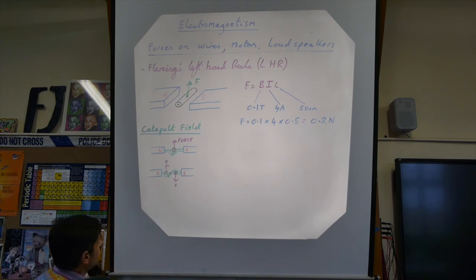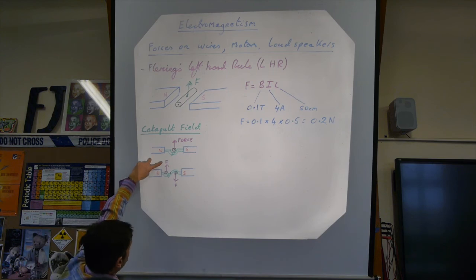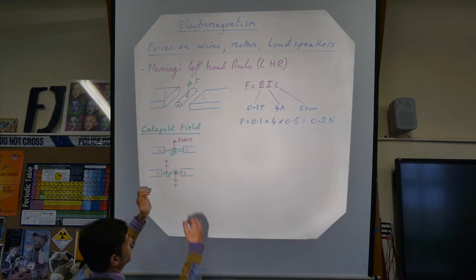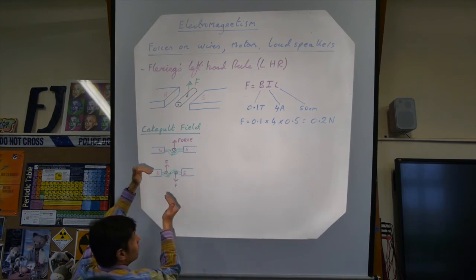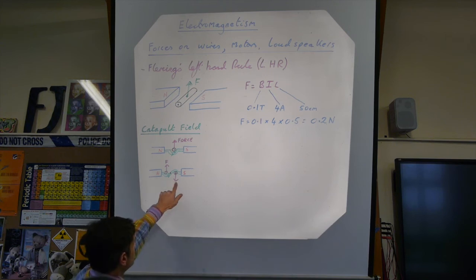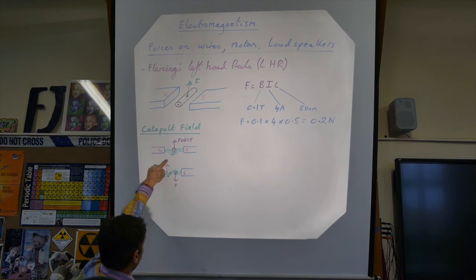Okay. These two forces are equal and opposite. So really that should be F and this should be minus F. But you'll notice they don't act on that point. So this one is away from that point. So there's a moment, there's some leverage here. Okay, it's off this bit of the syllabus. I don't know if it would come up, but the moment of this force is this force times that distance. But it's going to feel twice that moment because we've also got a lifting effect here. So that force times that distance and you'd add the two together.